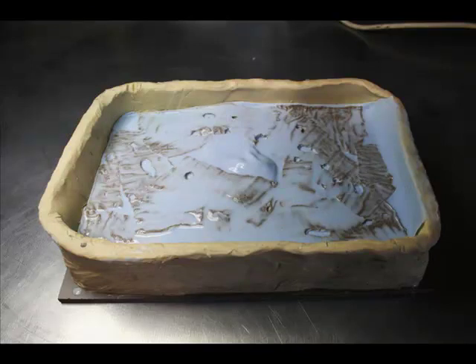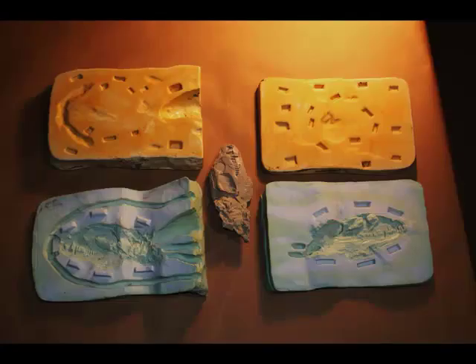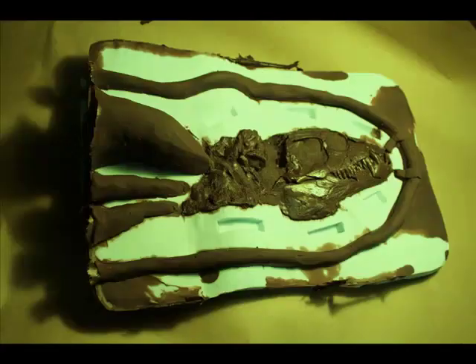I'm going through this quickly — it's a layup. I'm using nylon stocking material to reinforce it. You always have to find the bubbles in the nylon stocking material and cut them out every time. Here's the close-up of cutting out the bubbles. Here's the skull, here's the skull mold rubber. Rubber works better than anything else for putting together these sandwiches of mother molds and rubber. The contact area at the end of the skull is extremely tiny, but the bore of the escape channels makes the whole thing work much more efficiently.